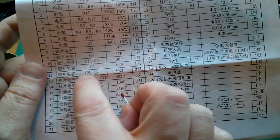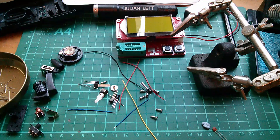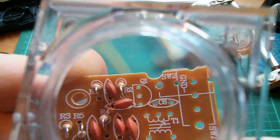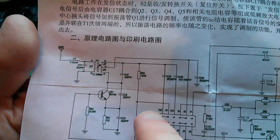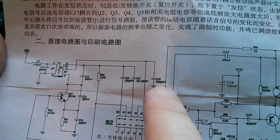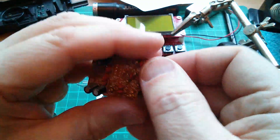What's this? 502. C5 and C6. Well, if I've done C8 — actually, I wasn't sure that was C8. I'm beginning to think that's a 6 now. That does look like 6, just above the inductor, the transformer T1 — I think that's a 6. It doesn't look like it's completely closed on that right-hand side. I'm going to go with that — C6. It's very near the inductor, so let's check the circuit again. That's C6, 502. It does connect to the centre tap of the inductor. One side of it connects to the centre tap of the inductor, so that looks promising. Let's shove it in.